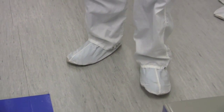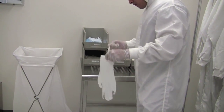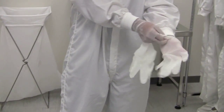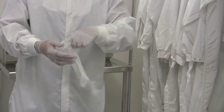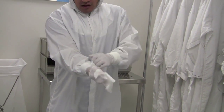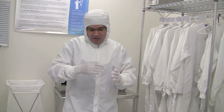Once you're good with that, you can put on a second pair of gloves — these will be your sterile gloves. Wearing two gloves is pretty important in this facility. If you're working with wet chemicals and your hands get contaminated or something gets spilled on you, it's a lot easier to take off the outer glove and put on a new one. If you only wear one pair, your hand will be exposed to the clean room environment — you might get oils, sweat, or grease from lotions on your hands, which can contaminate. So you always want this second layer of protection.